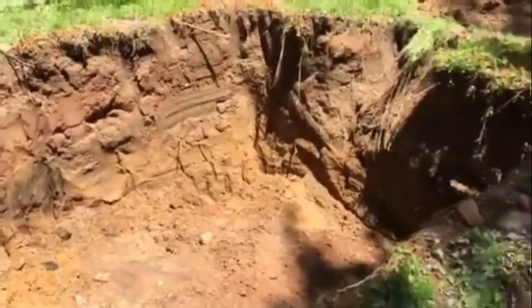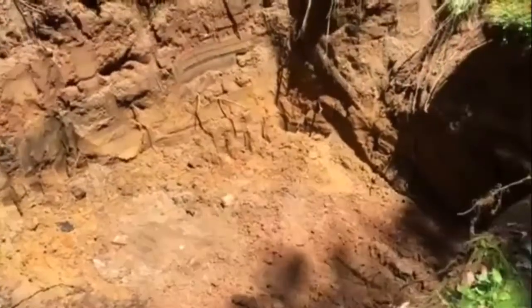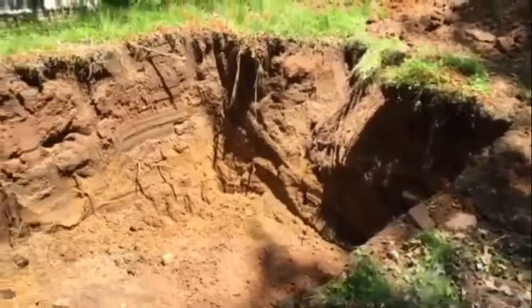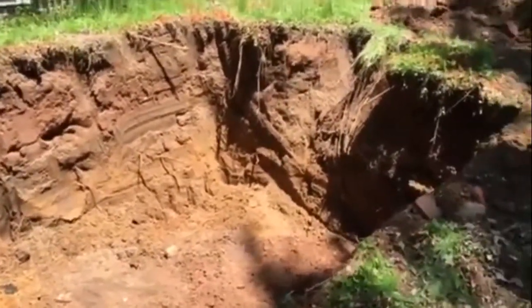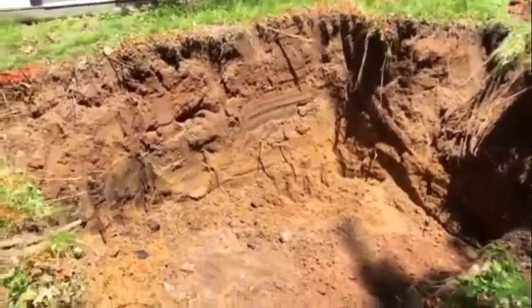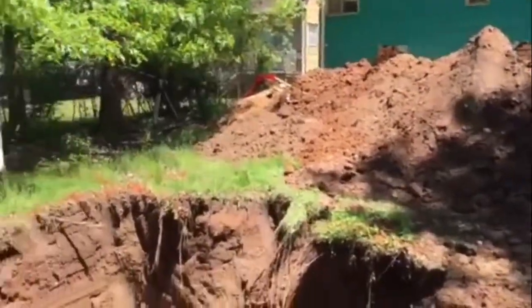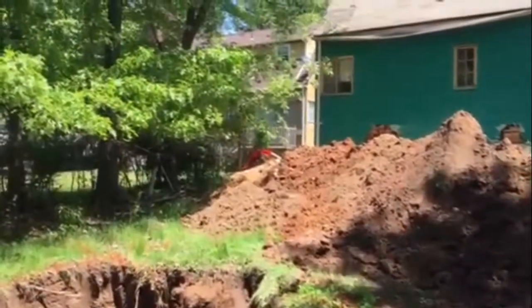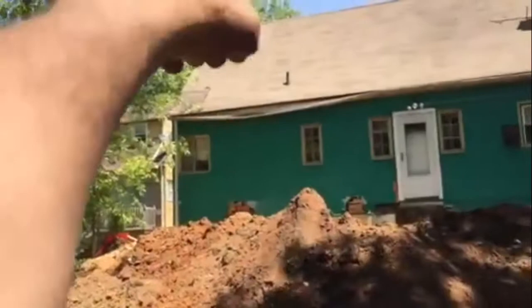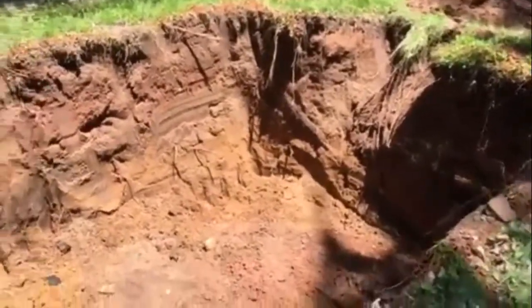So here is the pit — we're about seven feet deep. This pit is going to be dropped right into the hole, and once inserted, the casing will backfill it. We'll put shoulder stone in it, which is a three to four inch stone. That will get filled up inside the 500 gallon pit. We'll put the dirt around the pit, then dig a trench over to the addition and pick up the leader from the new top floor. The leaders will come down the house, go into the piping, and then the underground piping will be connected into the seepage pit.